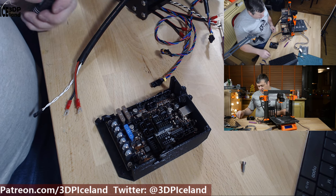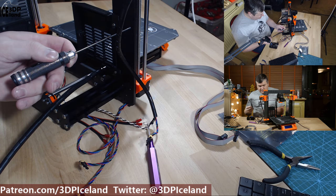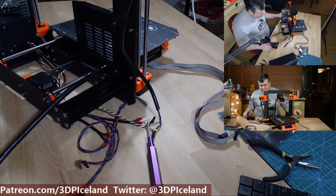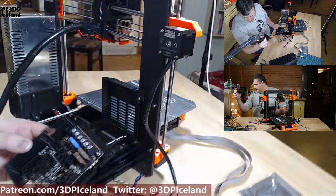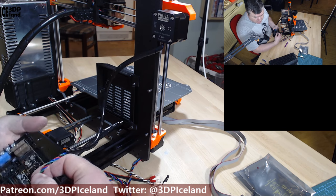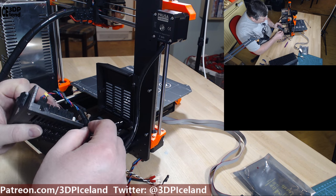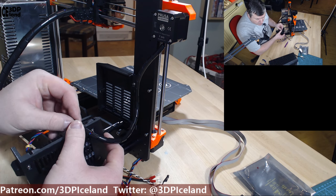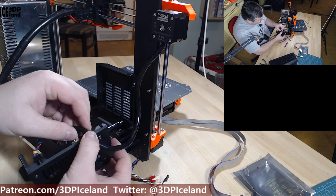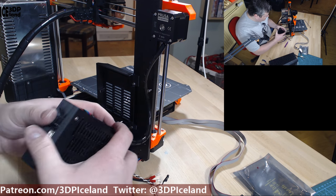In step 11 you prepare the cover, putting M3 nuts in the holes at the same height as the cover. Before you mount the board, connect the cable from the Y-axis, which is connected to the top connector here. Feed the cable wrap through the opening in the side of the board and leave a little bit of it inside. Put the remaining cable wrap into the slot — there is a slot here in the plastic. Now you have that secured.